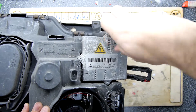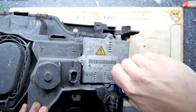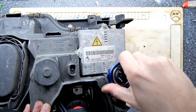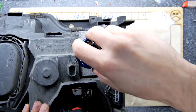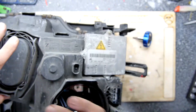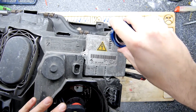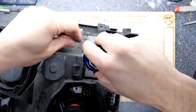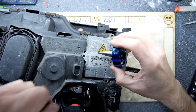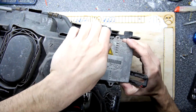Like all things in these cars, all of these bits are expensive, so if I could prevent the issue in a cheaper way I will. The main problem appears to be the fact that there's data going into these connectors — they're all connected by some sort of digital bus, and when things start messing around it all goes tonto and it takes out some of the internal stuff on the car. So you're in this weird scenario where an issue with your light module can cause your radio to stop working, or your traction control to start complaining — just crazy stuff. When I see corrosion on things, I just take Occam's razor and check them out first.